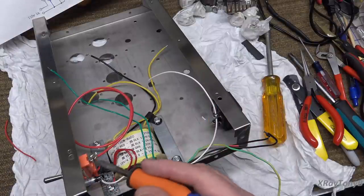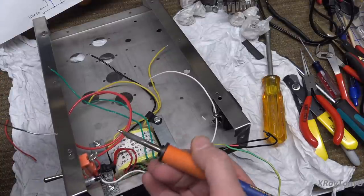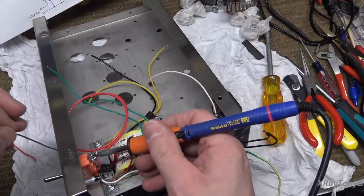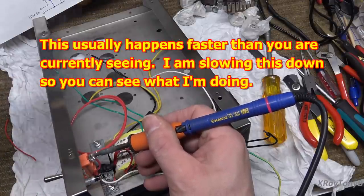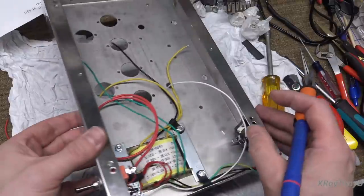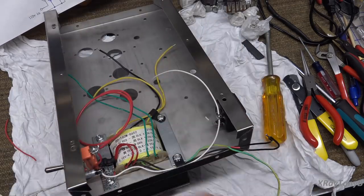I'll use a little heavier gauge solder. When you solder — and we'll do more of this later in the video — first make sure you have a clean tip on the iron for good heat transfer. Then place it on the joint and introduce a little bit of solder. That first little bit acts like a heat bridge, connecting the heat to what you're trying to solder. Then put some more in and just let it flow. You can see you get a really nice shiny silver finish — it shouldn't have any cracks, it shouldn't be dull, and it should flow out kind of flat, not like a round ball. That's what you should be looking for.